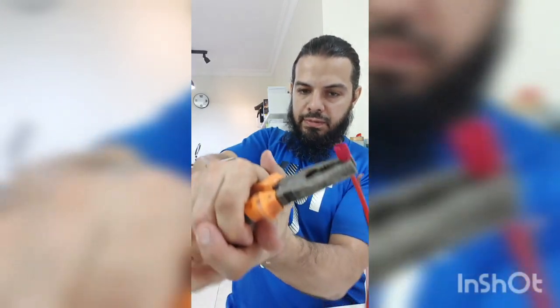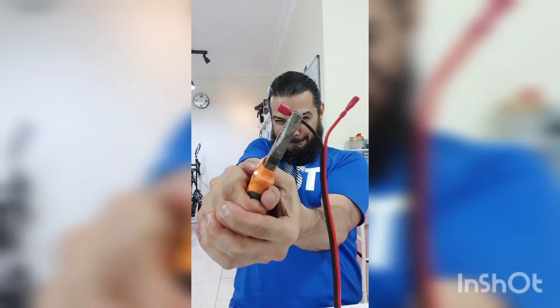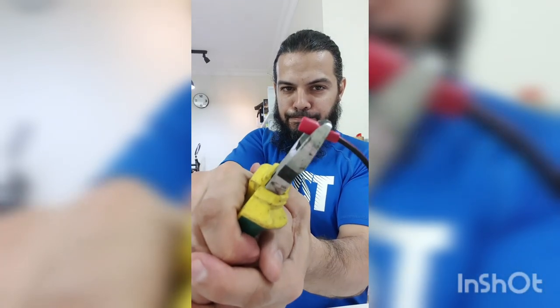With the wire going in, you need to crimp it. Crimping pliers would be great, but if you don't have them, just use your normal pliers and push it really hard. I'd even use the cutters a little bit just to give it a bit more crimp — don't do it too hard, you don't want to snap it. Try and pull it apart; if it doesn't pull apart, you've done the job right.